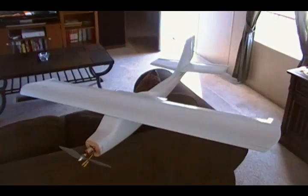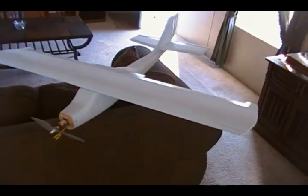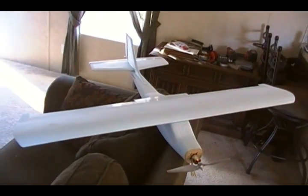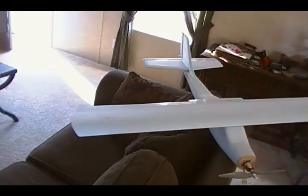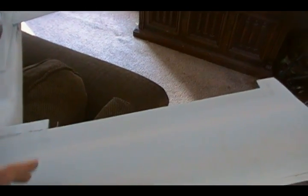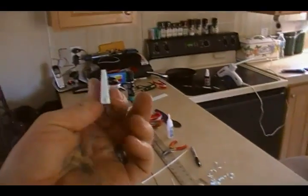Change of plans. I got the wing done last night, and today when I went to cut the dihedral slots I got to looking at this thing — I tested the engine thrust and it's got a severe amount of thrust. I put the carbon fiber spar in the wing and left it flat because it looks like it's going to be pretty aerobatic. I've got my ailerons cut out. What I did is tape the area top and bottom before cutting the ailerons, because the foam is so thin it just bows up. Taping it before cutting worked really well.